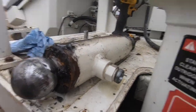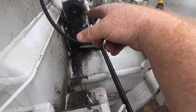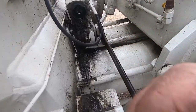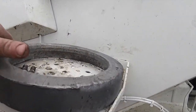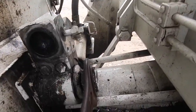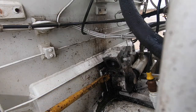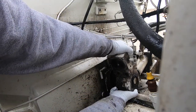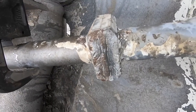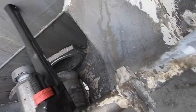We cleaned the bob clean, but that's the dirty side — that's the bottom. Now we got to finish working on getting this nut backed off and getting this plunger cylinder piece out of the way. We'll get some more stuff off. We got that piece off — it's trash. There's my cutting ring; it's not too bad, it needs to be turned. This big nut is giving me a little fit. Somebody at the factory decided to weld both sides, so now we're gonna get a grinder and grind the welds off.